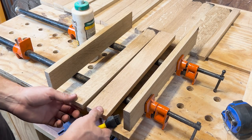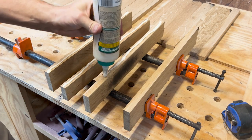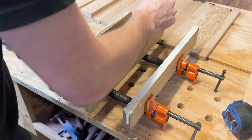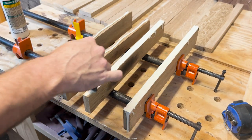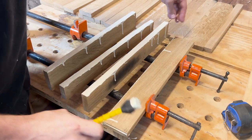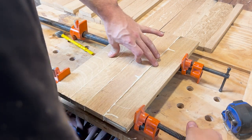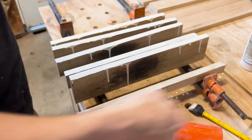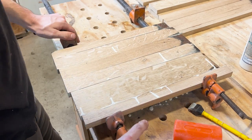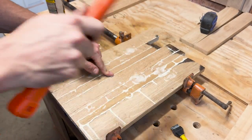I had the staves organized by size, and I grabbed enough pieces out of each group to make a 10-inch wide panel, because I'd need to plane them down again and my planer can only do pieces 13 inches wide max. I also needed the overall width to be about 20 inches for my final dimensions, so I'd end up gluing two of these 10-inch panels together later on. I mixed up the pieces so the weathering and charred parts are dispersed around, along with the different widths to make it random. I then grabbed my glue — type 3 due to its waterproofing — as it would need to be for this cutting board. I glued up the pieces making sure it was pretty well flat. In total I have 10 of these panels, making sure the numbered ends can match with an adjacent 10-inch panel to create 20-inch wide panels in the end.